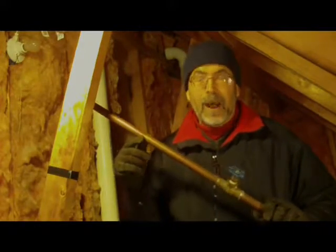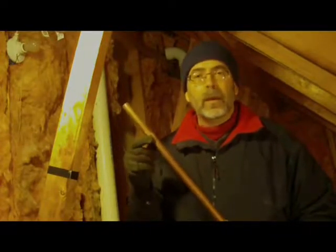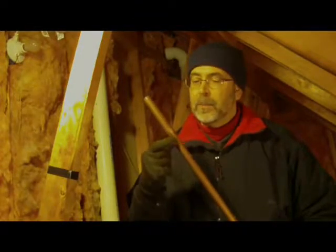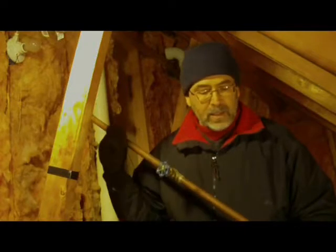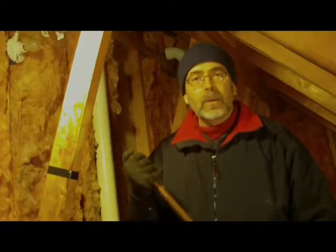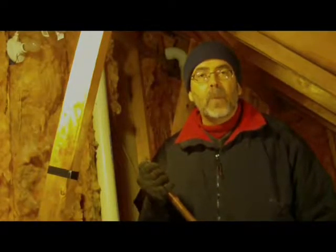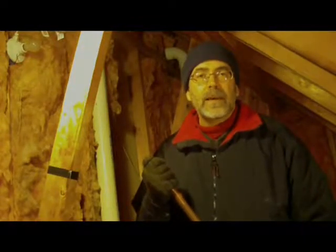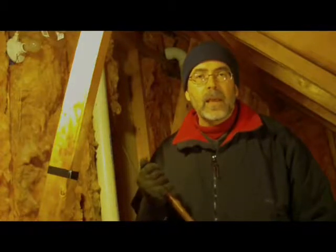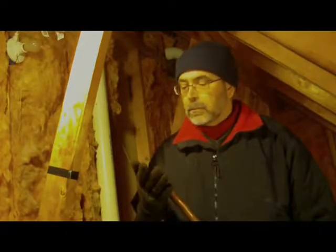I'm in an attic right now, it's about 33 degrees here in Atlanta at a client's house. We had a problem — a water pipe that broke, froze and expanded. You can see there's a pretty large gap here; there are actually three places that burst. I'm going to talk about how to replace insulation that's been water-soaked. It's very important to get that replaced as quickly as possible because mold grows into it, and there's the biological hazard of black mold, which could be deadly.